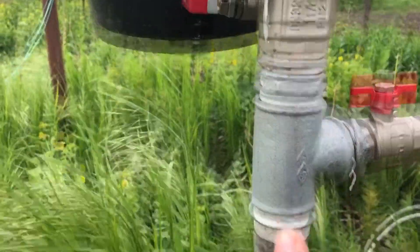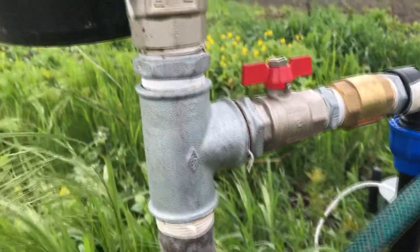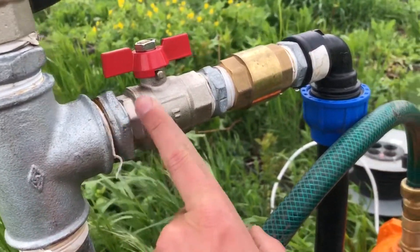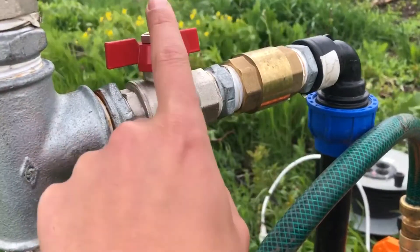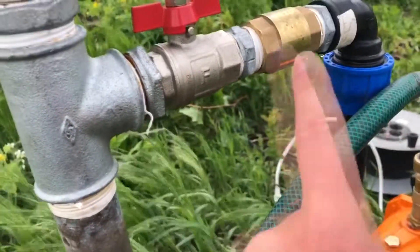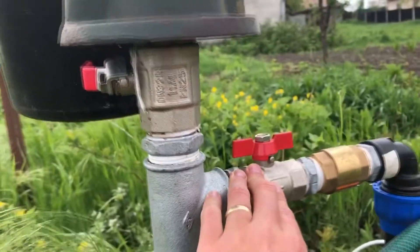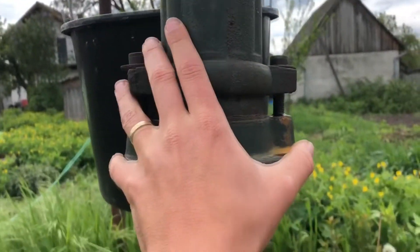This way you make sure the pipe keeps itself primed when using it either way. You can leave this valve open at all times — I'm not even sure it's strictly necessary, because if all your conduit is completely water- and airtight the pipe should never draw in air. But just as a secondary safety measure you can install it. Right above the T-connector you can screw in your standard manual pump.